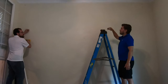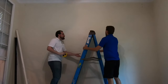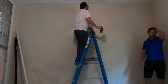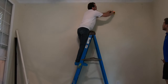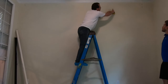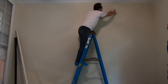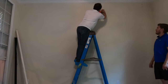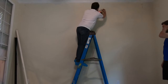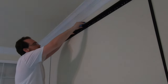What you're going to do is right here in the middle — find the studs. You don't need to find every stud, just the ones you're going to use. Get up on the ladder and mark them a little higher so you're more accurate when you go to mount the bracket into the wall. You want to mark each side — you don't want to hit right in the middle. Do that on at least three of them. Are we into the stud? Yep, hard part's over. Now that we have one into the stud, go ahead and put two more in. Make sure this is braced really nice and good.